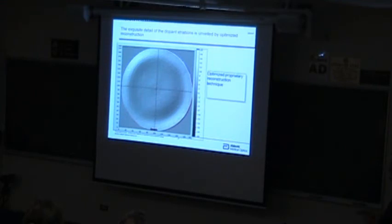So this particular tool, our spec on the performance is 0.6 nanometers. So I mean, we're down almost at atomic dimensions at this point. Now we had to go to pretty great lengths to do that. The whole tool had to be stabilized to 1,000th of a degree Fahrenheit in order for us to get there.